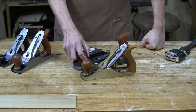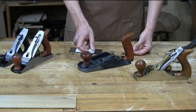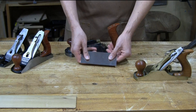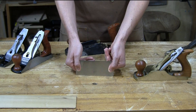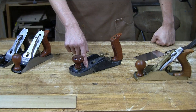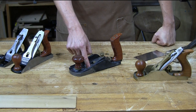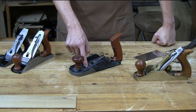We're moving very close to the action of a card scraper, which cuts at around 70-75 degrees. At this 60-plus degree angle, with support in front of the cutting action from the sole and a tight mouth, this becomes what I like to call a polishing plane. To get all the way up into a 60-degree presentation angle, you need a bevel-up plane. The downside is it's a little harder to push, requiring more force. And despite having a thick edge, the blade can dull faster because of that high, near-scraping angle.